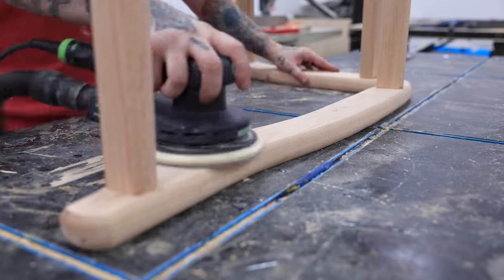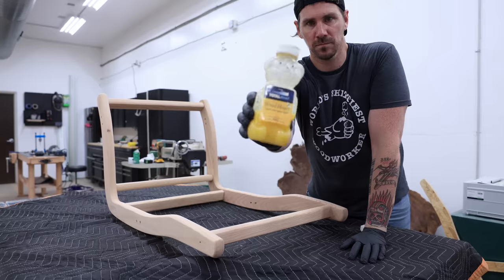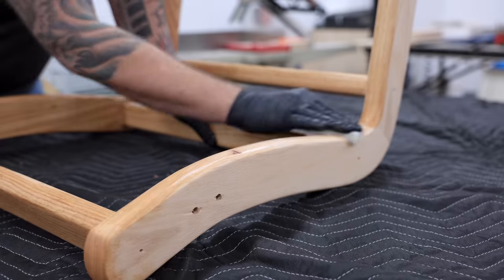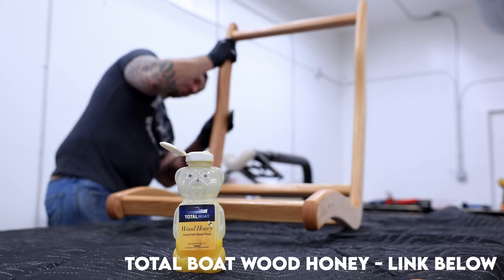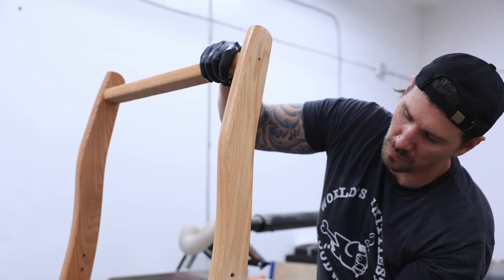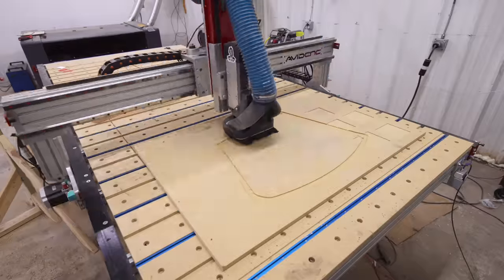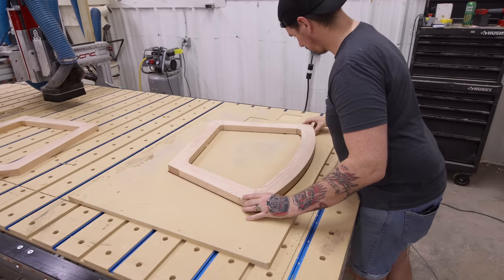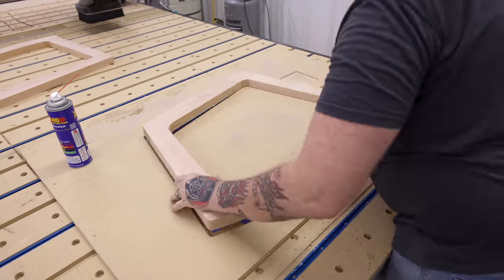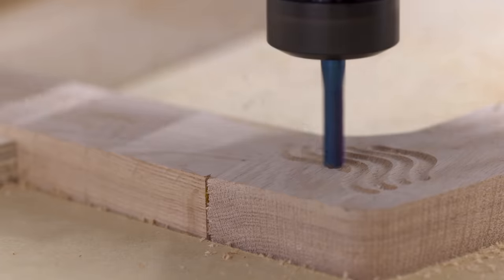When Jeff isn't running camera, one of his favorite activities is sanding. So while I'm working on making the files to carve the rocker assemblies, Jeff sanded the seat assembly to get it ready for finish. Just like I did on my red oak bed, I'm using Total Boat Woodhoney to finish the chair — I have to get the finish on before the next step where I'm going to weave in the seat. That wood honey finish on our bed has held up really nicely. Woodhoney is just the easiest finish you'll ever apply — all you have to do is rub it in and wipe it off. I've got a link for Total Boat Woodhoney listed down below that will get you a discount. While the finish cures, I switched gears to the rocker assembly where I'm going to carve in a vector wave pattern made using VCarve Pro — this matches the design element from the footboard of our bed. I'm using a 3/8-inch ball nose bit to carve these, and I'll have links for all the tools and materials in the video description.